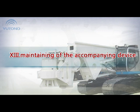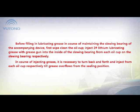13. Before filling and lubricating grease in the course of maintaining the slewing bearing of the accompanying device, first wipe clean the oil cup. Inject number 2 lithium lubricating grease with a grease gun into the inside of the slewing bearing from each oil cup on the slewing bearing respectively. In the course of injecting grease, it is necessary to turn back and forth and inject from each oil cup respectively till grease overflows from the sealing position.